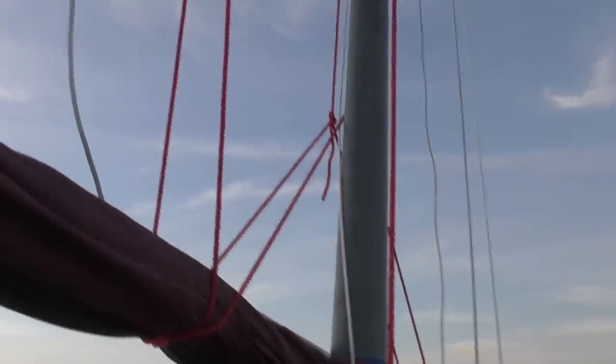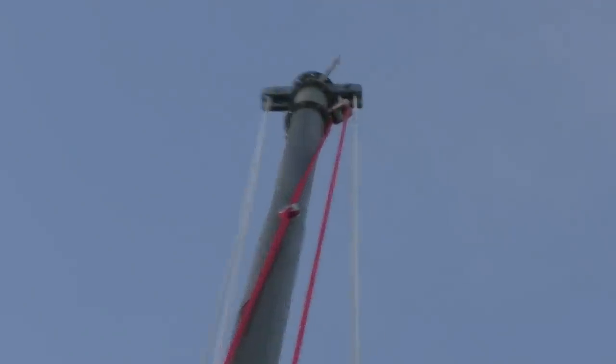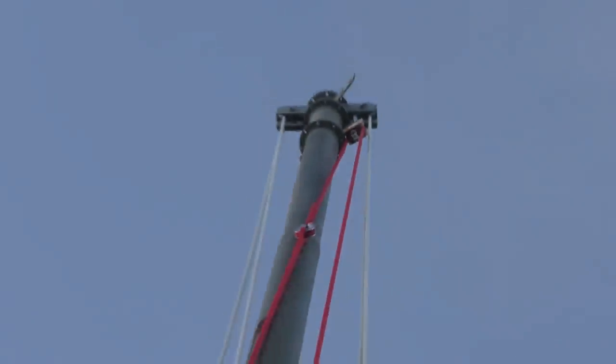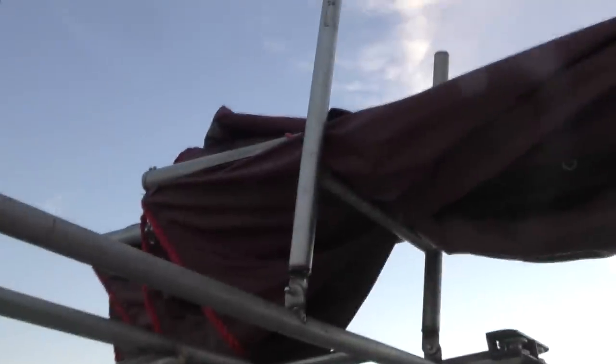The sun is going down but it cooled off enough that I could come out and play with the lazy jacks. I pulled them tight — they're the crow's foot looking things that hold the sail bundle. That's not really good up there at the top because it looks like it's binding as it comes out of the bottom of that pulley. Yeah, it is — that's not great. I need to move it to the outer side of that.